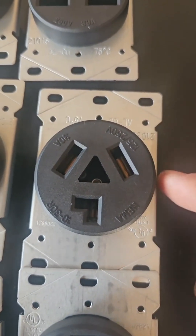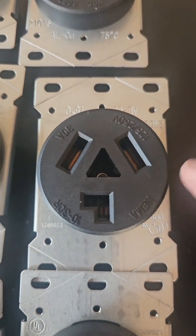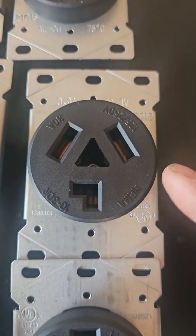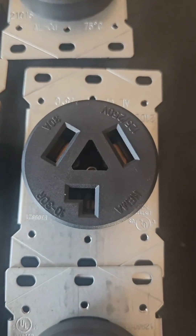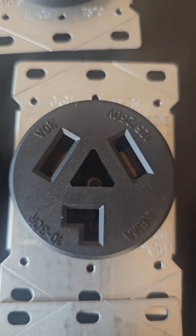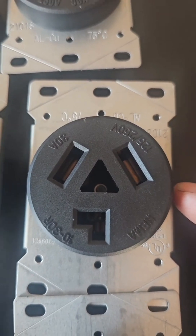This is so much a neutral that since 1975 this has been required to be fed with an insulated conductor. Unless it's fed with SEU from a main panel, it needs to be an insulated conductor. That means these were never allowed to be fed with a 10-2 Romex, and if they are fed with a 10-2 Romex they're not even grandfathered as an existing location.